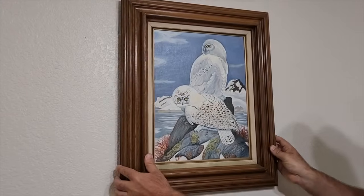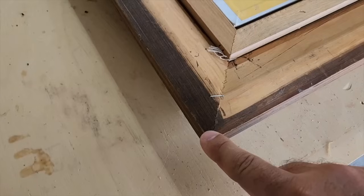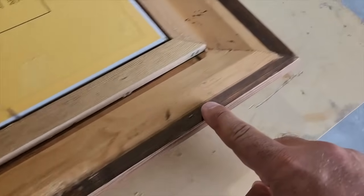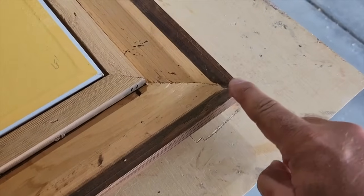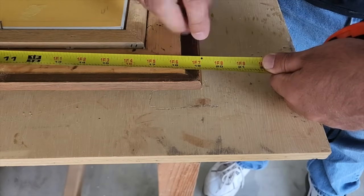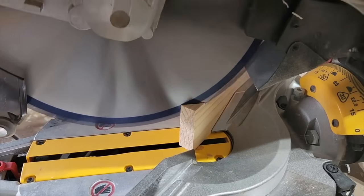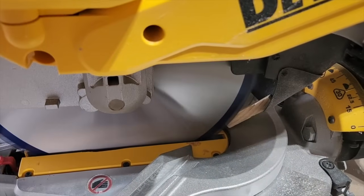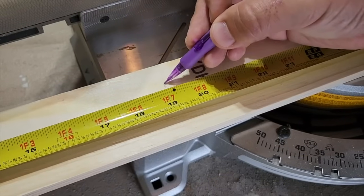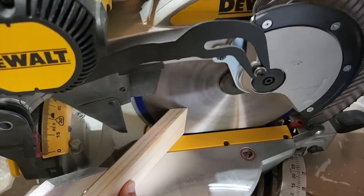Forty years ago my grandma painted this wonderful painting and I want it to last forever and make it a keepsake. We're going to start on one corner of the painting and go to all four corners — we've got to measure so we can build a frame around the back. On the top it's 19 inches, and we need two pieces cut at a 45-degree angle to match the bevel of the painting. Start with one end, cut it, measure 19 inches, and cut a 45-degree corner on that piece.